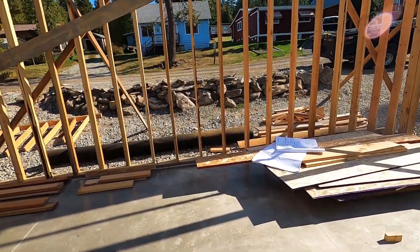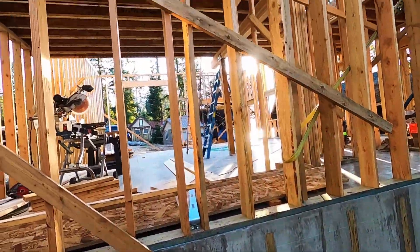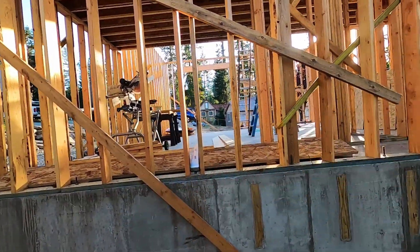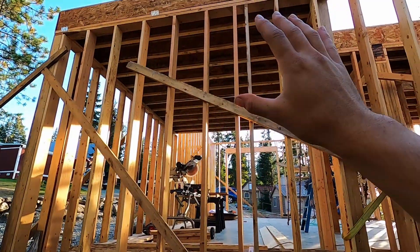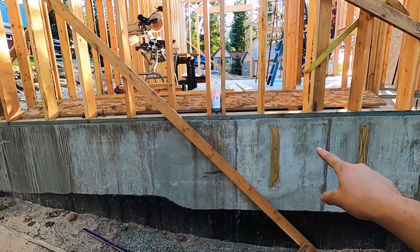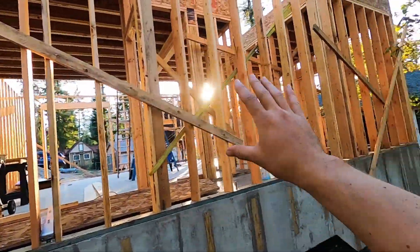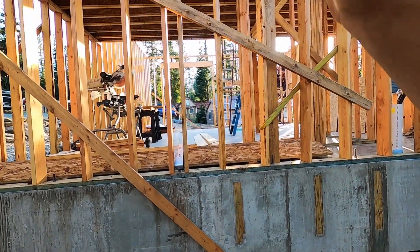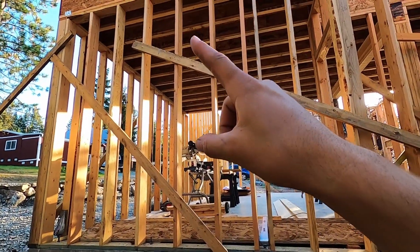Still working at it, got a couple more hours of daylight left — we're not giving up yet. Quick update: we ran into a problem. We noticed while we were up there the building was moving a lot, and the reason is we don't have any sheeting on the side. So we are stopping what we're doing up there because we're putting way too much weight up top and it's not all sheeted yet. We're going to shoot a laser line, get everything leveled out so we know the building is square, and we're going to sheet this whole back wall because we need it sheeted to have reassurance that everything is squared off.